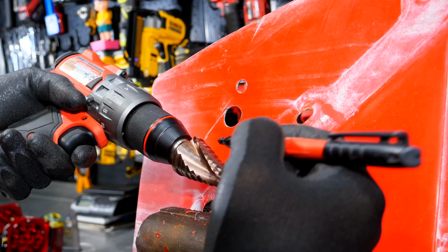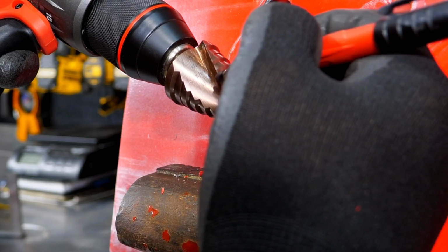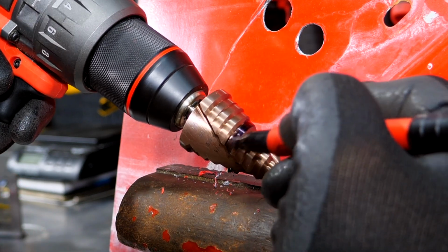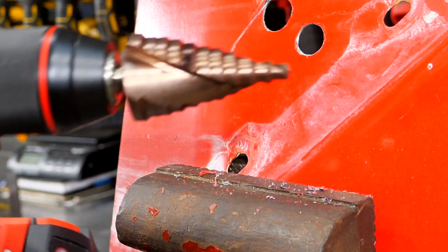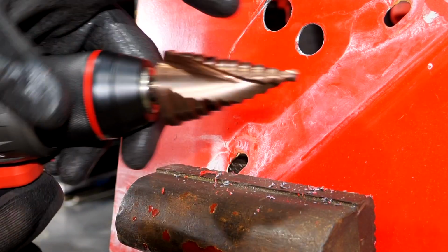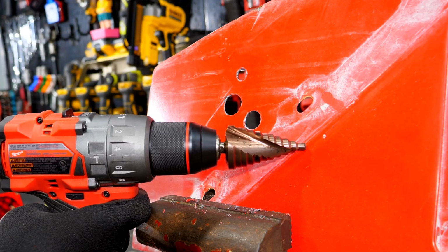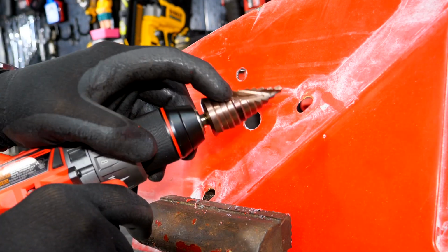And I will tell you, find the one that you actually have to drill to. So the 1-inch, which is right here. And I say you should actually color the last step you're going to drill. Why do I say that? Good question. Got to do it over here too. I say that because the next time I need to use this drill bit, if that one's colored, then I have to take some acetone or something to take that off. However, if I've got to drill to that, then it's going to be drilling through that metal, and that metal will help scrape that off, so I know that's not the next one I have to use the next time. Does that make sense? So that's why I say color the one you're actually drilling to, the last step you're actually going to drill.